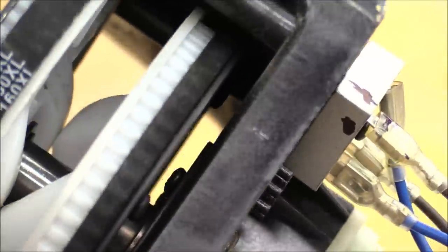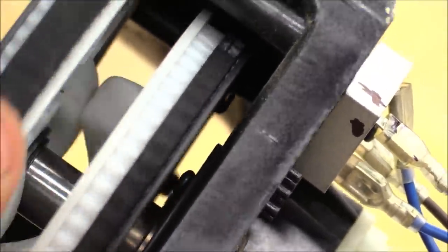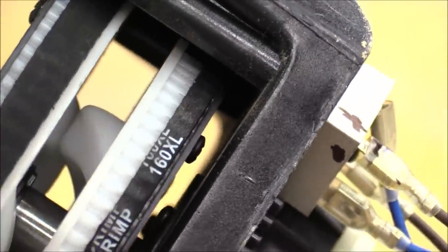The spindle sander works pretty simply. There's a geared shaft that comes out of a motor, two pulleys, and one of those pulleys has a few less teeth than the other. There are nodules that stick out and rub against each other, so as one spins a little faster than the other they raise and lower the spindle shaft. It's pretty straightforward.